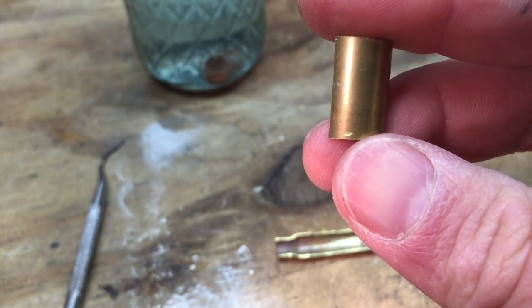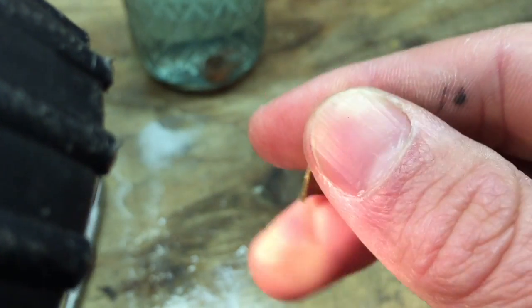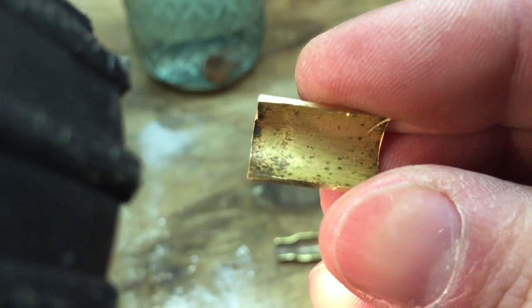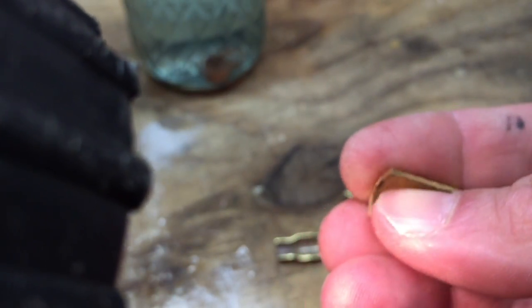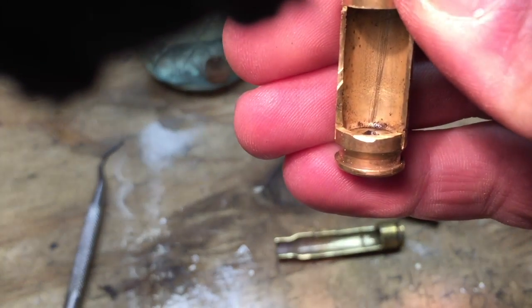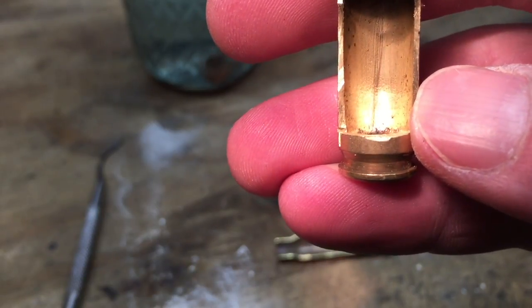On the cut piece you can see some coining right there above my thumbnail. Coining is when the brass gets really shiny from being work-hardened, and stretching will work-harden it. You can see the brass has a stretched-out look down towards the case head. If you feel it with your thumb, the rest of the case wall up higher is smooth, but you come down here and it feels a little rough — kind of pockmarked — then it smooths out again. Right there is where it's stretched.